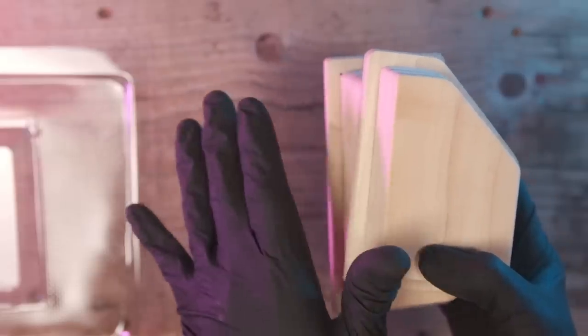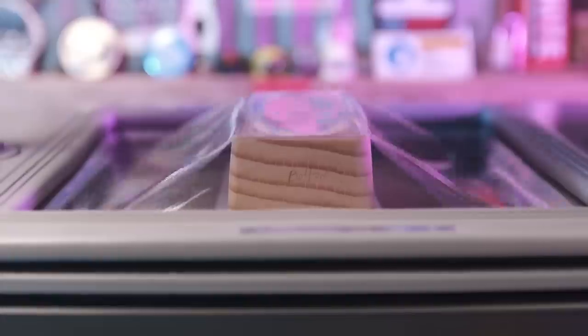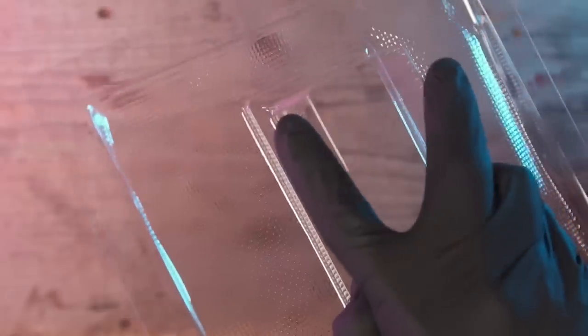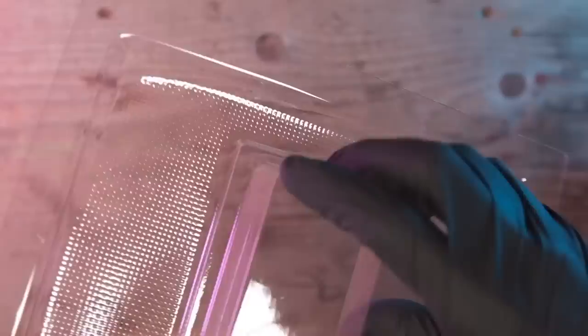One of the biggest things is, I found out I was letting my plastic heat for too long, look at that sag. I'm telling y'all this so that you will know that you might not need to let it go that long. So I spoke with my contact about the FormBox, and she told me, you know what, Craftsman, I got to where I don't even use the timer. I just watch that thing. And then things just kept getting better and better. Look at that right there.